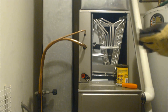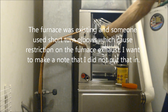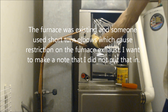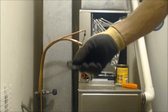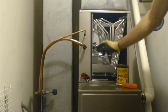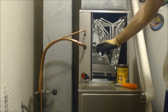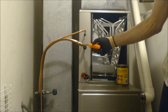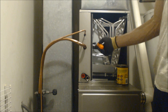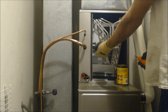As far as these plastic pieces are concerned, right where you would normally install - I usually just cut these and slip them back on when you're done. This is a thermostatic expansion valve - this evaporator coil has a TXV bulb already installed. If you were to braze here, you want to do it really quick - you really don't want that bulb on there.